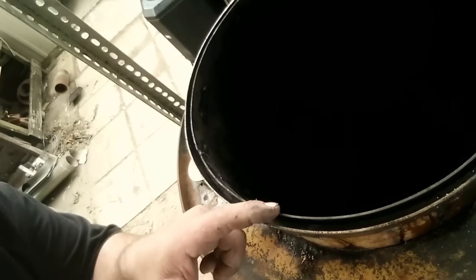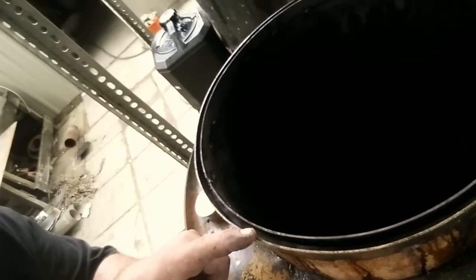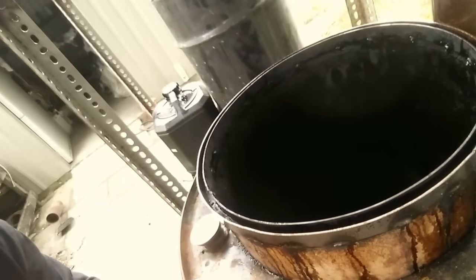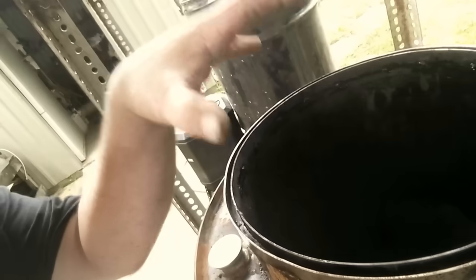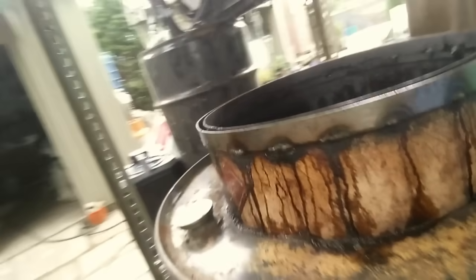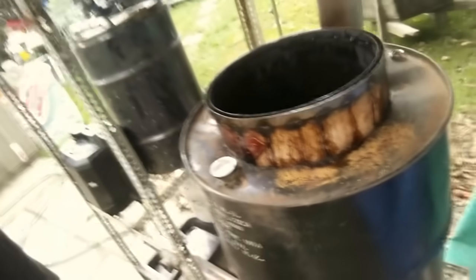You'll see around here that I've got a double labyrinth seal added on now from two steel bands — that's going to provide an airtight seal when I get the fiberglass rope tucked into the bottom of it. It's the same fiberglass rope that goes around the door of wood fireplaces to make them gas tight, and the whole lid will have a clamping mechanism to pull it down tight. You can see that I've had lots of leaks all the way around, and that's something I'm going to be attending to when I put the insulation on the drum.